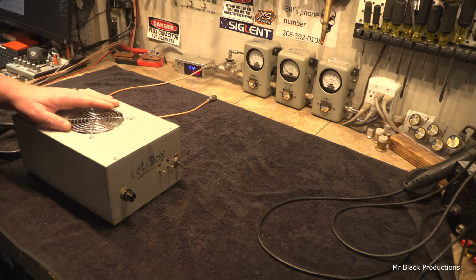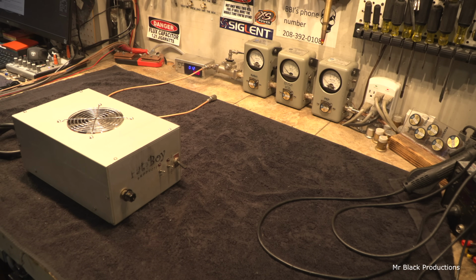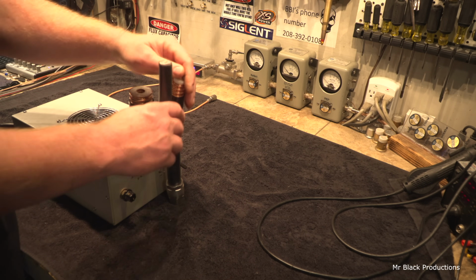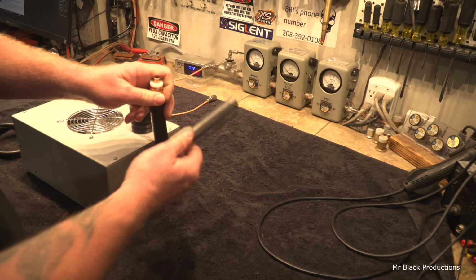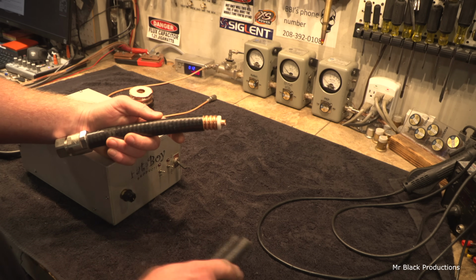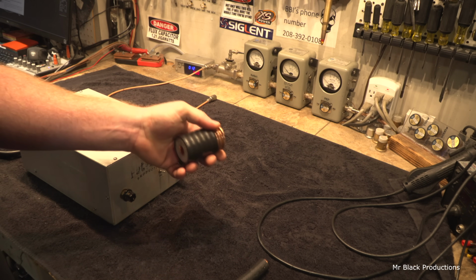But if you have a pipeline that isn't like Derail and his brother or the usual coax guys, because I've checked with all of my guys, 1.25 inch is getting really hard to find. The fittings are getting incredibly hard to find. Here, I'll give you an idea. This is what I'm after. This is what I'm on. This stuff will disintegrate. This isn't quite big enough. This is 7/8. This is RG-218. And I'm here to tell you, I've put 30,000 watts through that piece of coax now for almost 4 years. I'd go to 7/8 heliax, I'd just rather have the buffer of 1.25 inch.